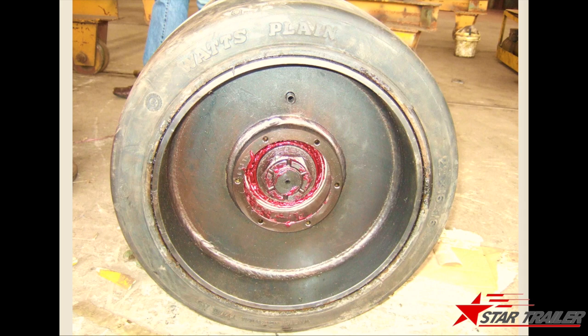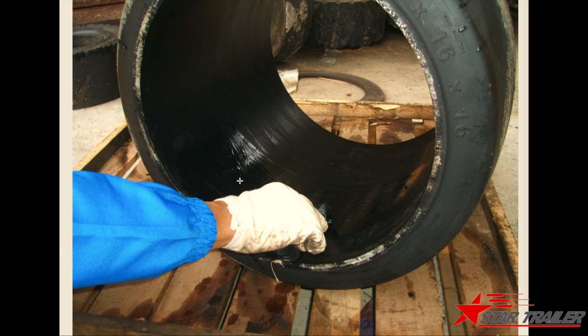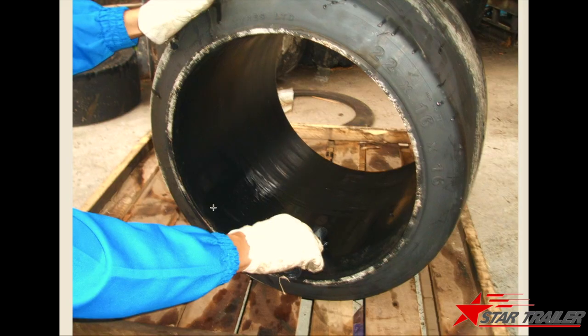To make sure it is greased well — the grease oil needs to be checked very carefully. You need to maintain the trailer every half year. Because if you don't, it will bring you huge damage to the axle and you'll need to change it. We also have a pocket in the middle of the trailer sometimes, if our client requires. You can see it is for empty lift only. So when the trailer is empty, you can use the forklift to lift it.